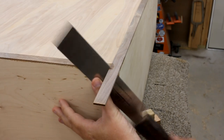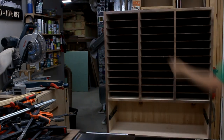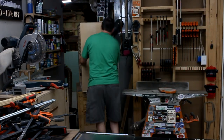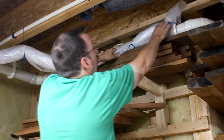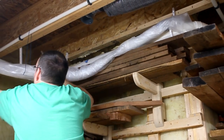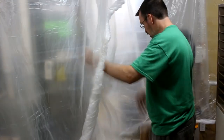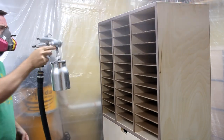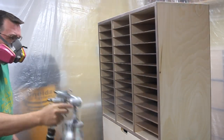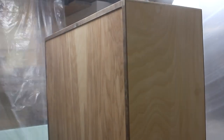At this point, I could cut off any overhanging trim pieces, give the entire thing a good sanding, and do a thorough last-minute inspection before wheeling it into my finish room. You didn't know I had a finish room? Well, I don't — but what I do have is a bunch of cheap rolled-up plastic drop cloths taped to the ceiling, making the perfect little kill room. I sprayed down three coats of satin-finish polyurethane, and sanded between coats with 220-grit to keep the surfaces really smooth to the touch.